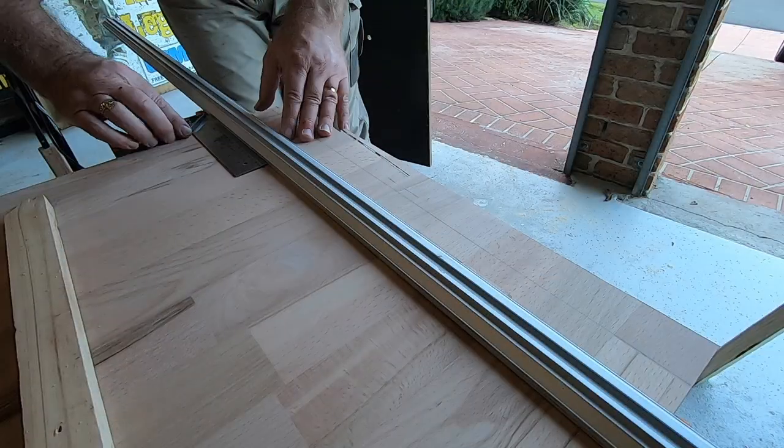It's the saw. It is. I can see when I put the saw on the timber against the fence that the blade isn't tracking square with the edge of the fence, and that's why it's veering off to the right and getting stuck into the wood. It was a $49 saw. Maybe I should get a proper saw.